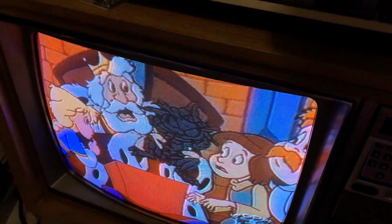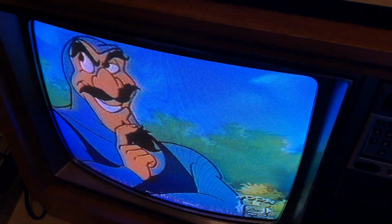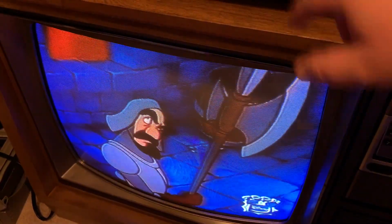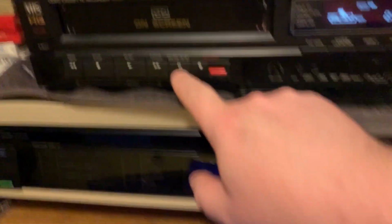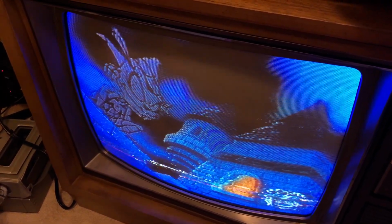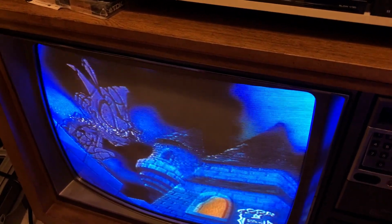But here's fast forward search on extended play. Very clear, as you can see. And then we'll do 15x by holding the button in. And there's 5x. Here's play. That's pause. It does have the noise cancel function of early 80s units where it just very slowly moves the tape till you get a noise-free image. It's just hard to do on there, that's pretty clear. But yeah, just a 2-head unit here.